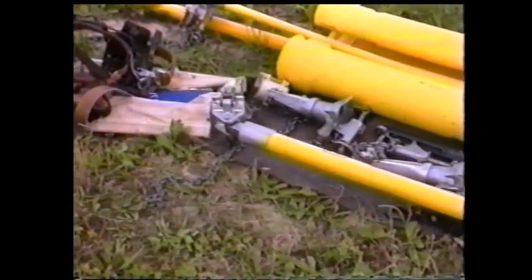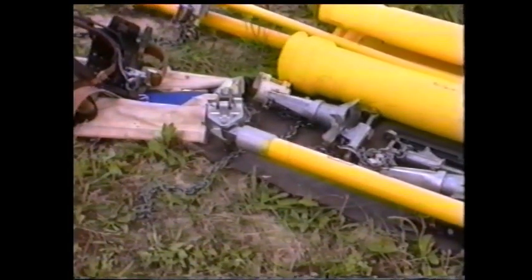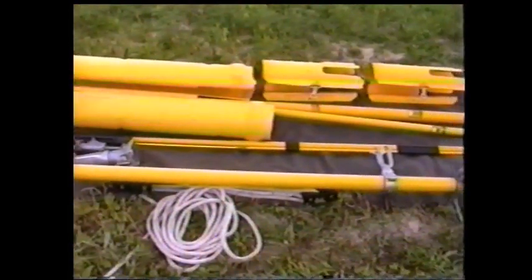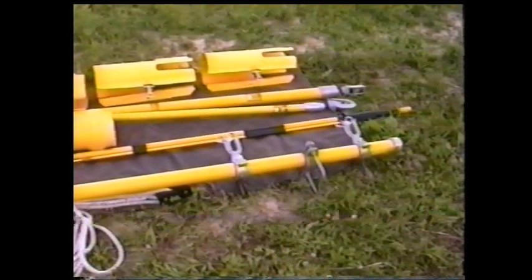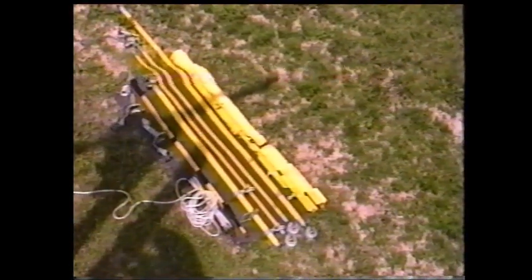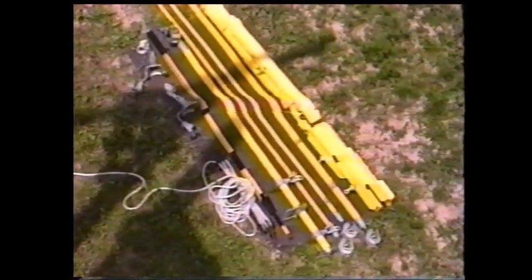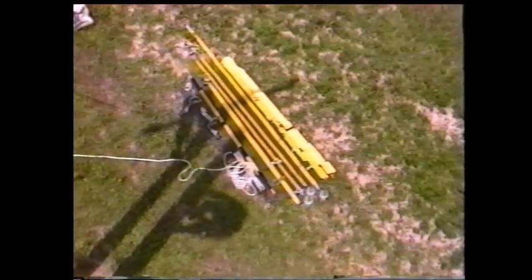This video will demonstrate a method for removing phases from a three-phase crossarm by using the auxiliary sidearm. The tools required for this method will be an auxiliary sidearm, a 14-foot wire tong, a 10-foot wire tong, two pole saddles with extensions, two pole clamps, one set of insulated tackle blocks with rope, two 8-foot shotguns, two universal sticks, and two line guards and a crossarm guard to cover up the phases and crossarms.